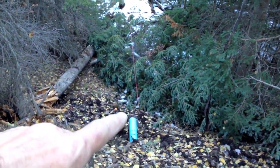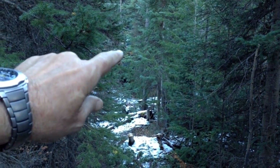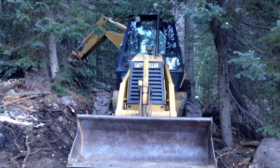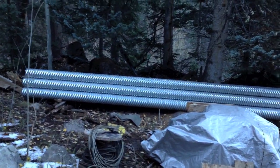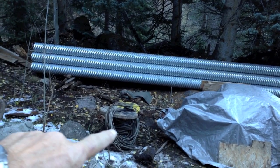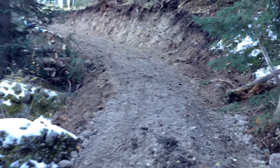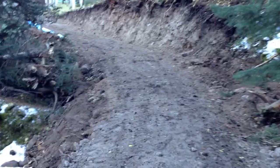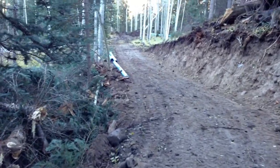From the weir, the water goes underground and drops several feet through the pipe to where it will come out and enter a bridge that fords the creek running through here, and then reaches the other side of the creek where we continue the pipeline. On the other side of the creek we're getting ready to put the materials we've gathered together to build the bridge. There will be culvert held up by steel wire, and inside that the pipe will go. Once we come off the bridge, it's going to continue out through this cut we've made to grade for the pipeline penstock to continue down the hill.